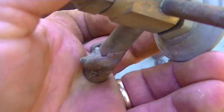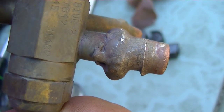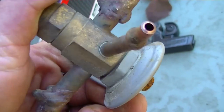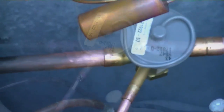We have cut our old valve out and as you can see it looks like it has been changed before — at least I hope it has, I don't think Rheem would send it like this. You can tell there was some not-so-good brazing and there was heat damage on this valve. We've got the new one fitted in down there and we're going to go ahead and braze it up.